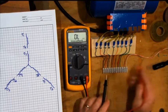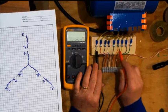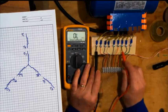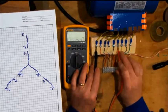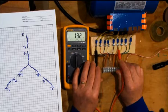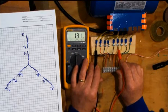Anytime you're going to figure out the leads of a motor, you start by taking your meter, putting it on ohms, and testing from wire to wire. You're looking for either three or two wires with readings. I got 13.2 ohms from this black wire to this orange wire. I keep going and I get nothing else. So leaving my lead on the orange wire at 13.2, I check everything else — only two wires have 13.2 ohms, no continuity or resistance reading with any other leads. Since I have a pair of wires, that immediately tells me I have a Y-connected motor. I don't know if that's T1 or T4, T2 or T5, or T3 or T6 — I just know that's a pair, and I have 13.1 ohms as my base resistance.